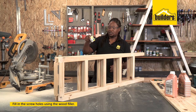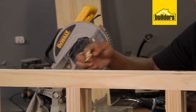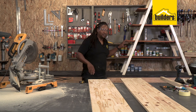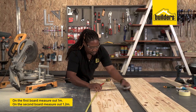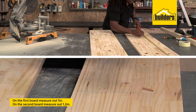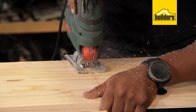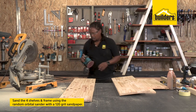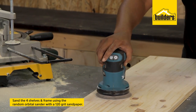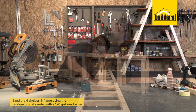I'm now going to fill the holes with wood filler — we've got a nice pine wood filler. Just use your finger to apply, pull off any excess, and make sure it's nice and flat. Let that dry and get started with our shelves. We've got four shelves from two 1.8 meter boards — we only have to make two cuts. First one at a meter, next at 1.2. I'm going to use my trusted jigsaw; always make sure you line up the pointed edge with your line. Don't worry about the little burrs — we'll sand these all off at the end. There we go, we've got our four pieces. Give these a quick sand using a random orbital sander with 120 grit paper, going over the complete board, which helps with staining and sealing. Now that all the shelves are sanded, let's give the A-frame a good sanding too.